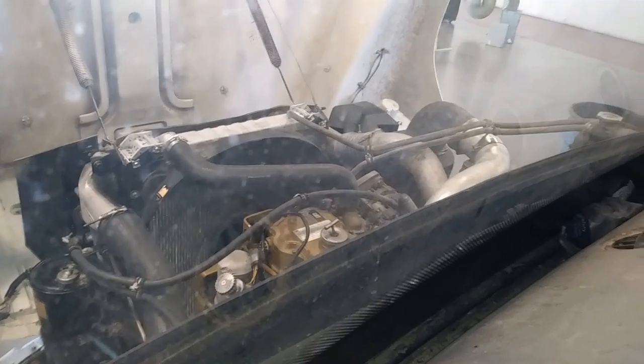On older engines they would use just the pump — the pump would be timed to the crankshaft and there was really no electronic timing. But on an ECM, or electronic control module controlled engine, it needs to know precise timing to deliver fuel and needs to know the engine RPM. Getting back to this engine: it started and ran, came in the shop, but after shutting it off it would not restart. The reason ended up being the timing sensor, and we're going to show you how I figured that out.